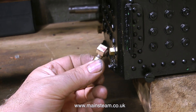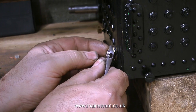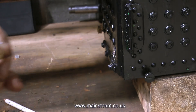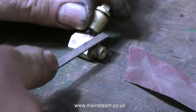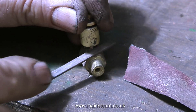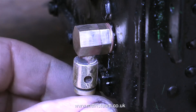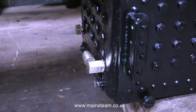Back now to the Garrett tractor — this is what's left of a blow down valve; it's been broken off. I'm going to repair and refit it, but I'm not really thrilled with it as a piece of equipment. I machined a piece of brass hexagon bar, cut a 5/16 by 32 threads per inch thread on the end, drilled the hole down the middle, then silver soldered the entire fitting onto the end of the original one. I don't know how much clearance there is between the belly tank and the throat plate, and this fitting is sticking out about a quarter of an inch more than it should. If it gets in the way of the belly tank, I will have to think again. I have a sneaking feeling I will be making a new blow down valve for the engine.